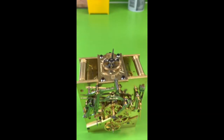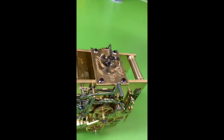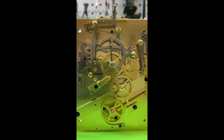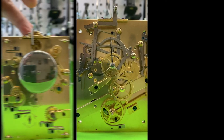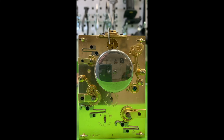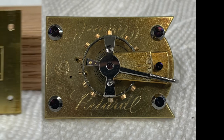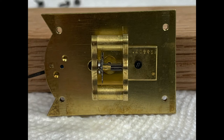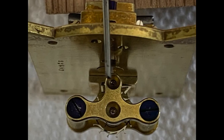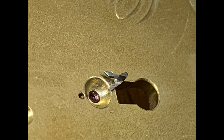Here's a little bit better shot of the platform without the glass and the case interfering. Here's some good pictures of the balance platform. You can see that only the balance wheel is on top. Underneath is the pallet fork or the verge and the escape wheel. It's mounted horizontally so you don't need a contrary wheel, just a normal fourth wheel for a typical type clock escapement. Here's the pallet fork sticking up from the bottom to engage the roller jewel.